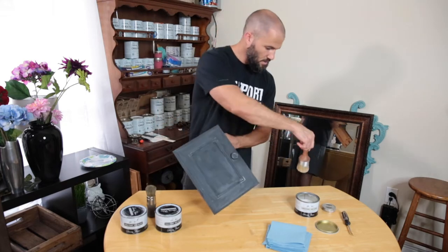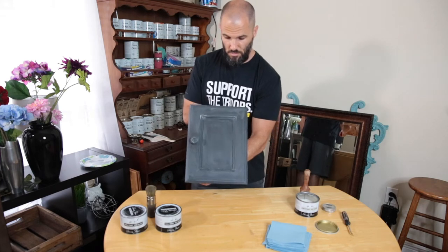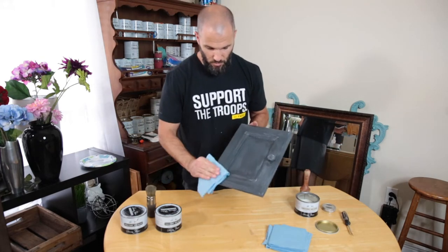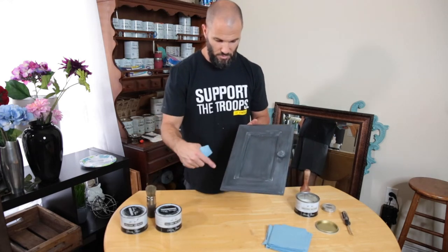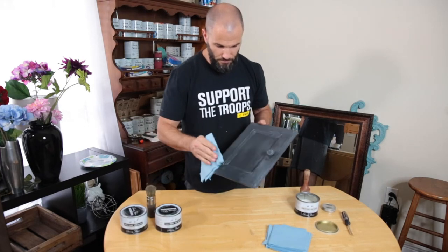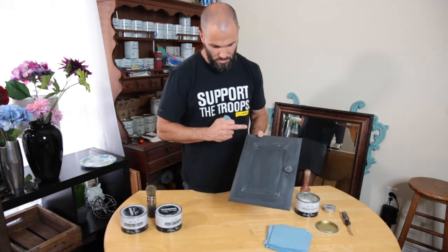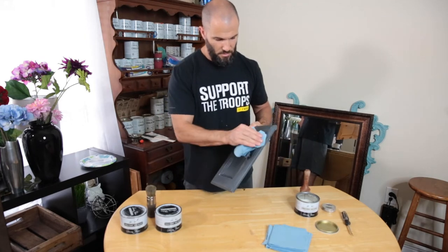Okay, so as you can see, it's really just darkening the color. The graphite, just kind of wipe it all back. We're picking this thing up because it's making too much noise against this table. But yeah, look at that. That's cool. So you got some streaks from the wax, some streaks from the Paris Gray, and then what was underneath there is that graphite. It looks awesome. So that's kind of what you're looking for. When I was doing this particular finish, I wanted to have streaks so it looked kind of like stone. That's Black Castle.